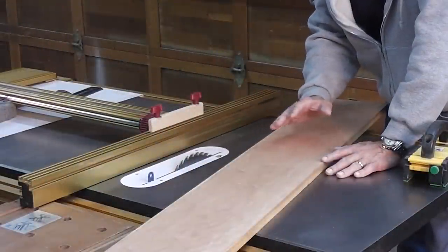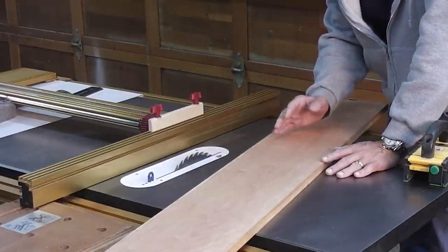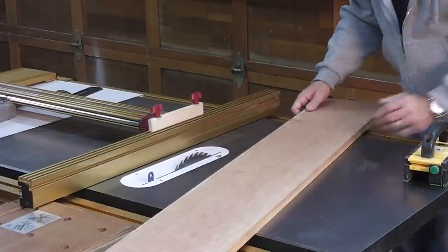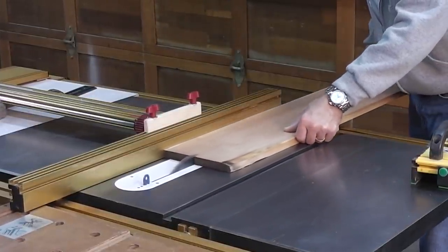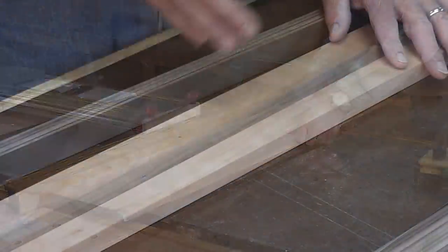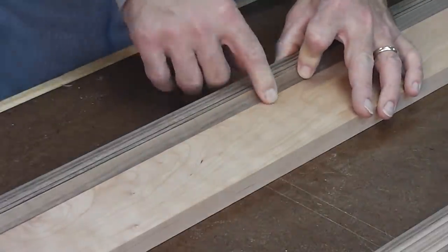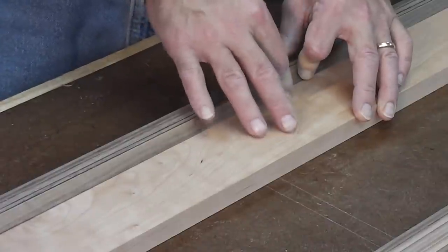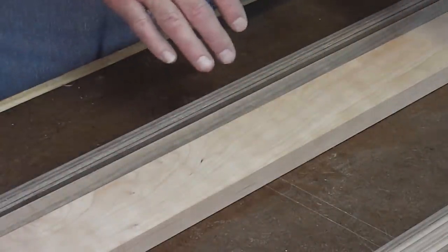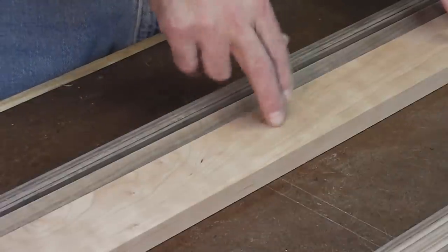This is the cherry that's going to be the field of the frame for the most part. I've got the fence set at three and three-eighths. I need to make two pieces about 54 inches long and several pieces about 43 inches long. Here are the pieces I currently have milled and this is how they're going to lay out. This is the field, this is going to be the border or edge of the piece, and then this 45 is going to fit in here. Inside, there's going to be an inlay made out of maple. So before I do anything, I've got to make the inside of this frame so I can lay out the corners, diagonals, and things I'm going to put in here.